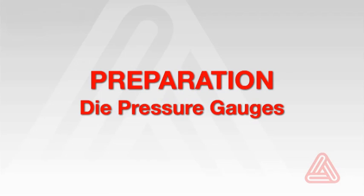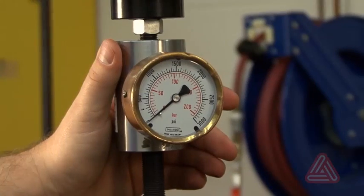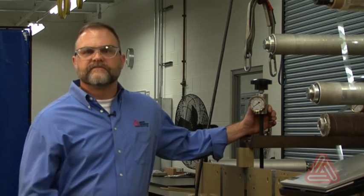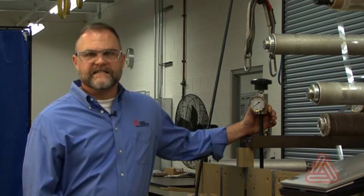If you're having difficulty scoring the liner, using razor knives after matrix stripping also works well. The next step in preparation is making sure you can control the cutting process, so die pressure gauges are definitely recommended. They help to monitor the die throughout the run for pressure changes due to heat expansion, which can change the die cut depth. They also help monitor as part of a preventative maintenance program so you have an idea when the dies need to be replaced.